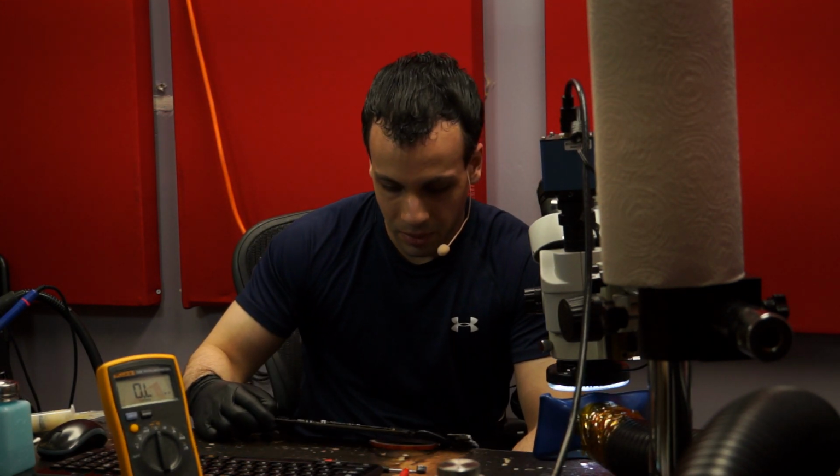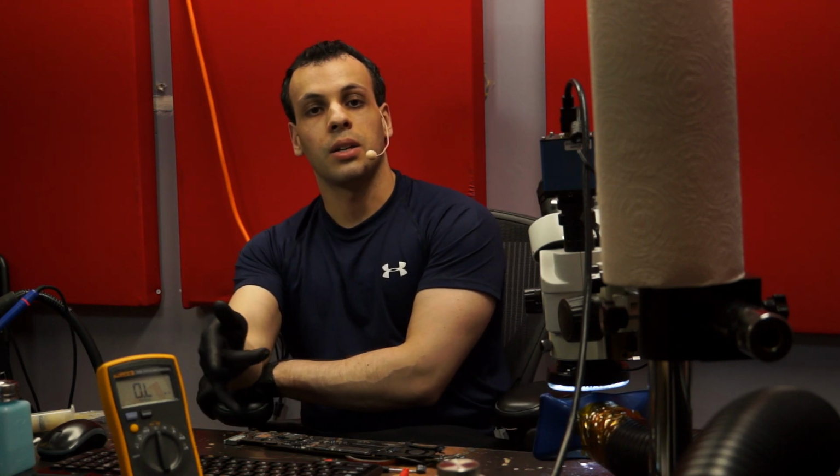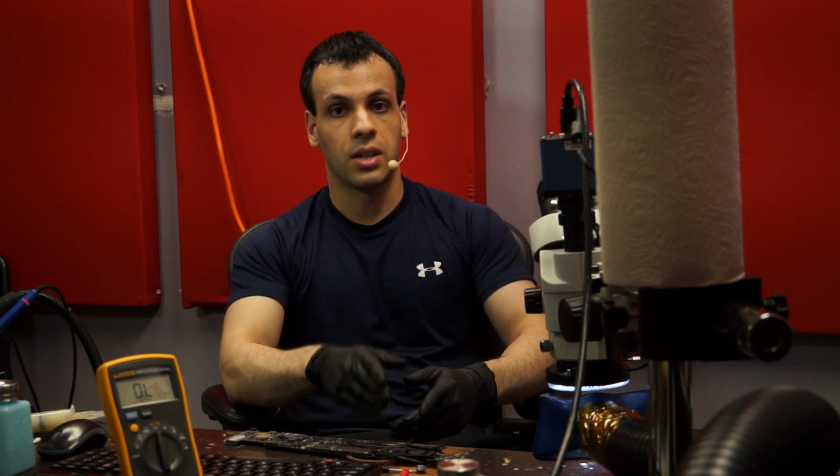And one thing to note that I do want to test on here is I did use an SMC from an 820-3437 on an 820-00165 or 4 board. So we're going to see if there's any negative consequences to that. If there are negative consequences after the testing, I will update everybody in a later video. You should never assume that an SMC from one board is going to work on another.